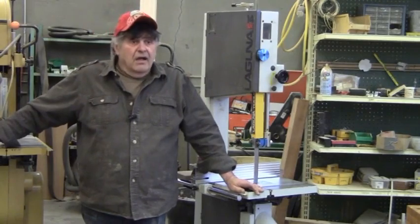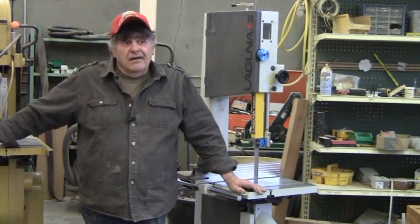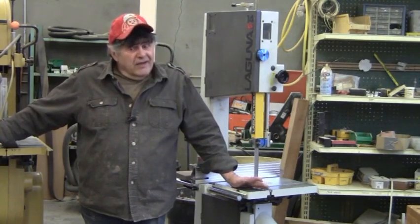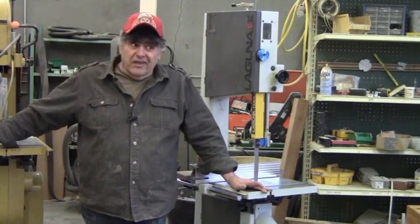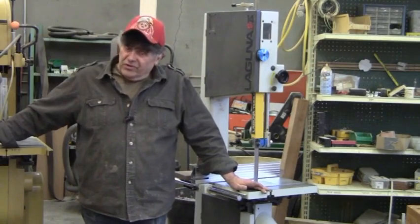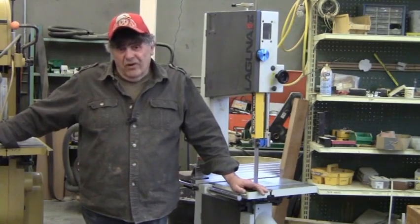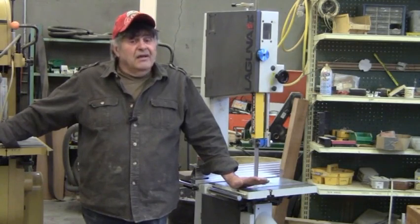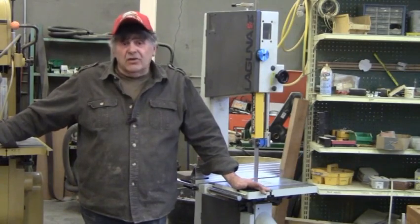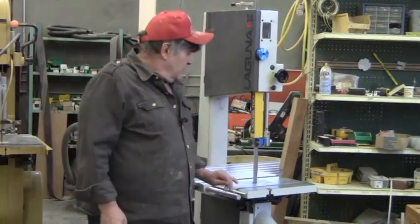Makes it beautiful. The other thing it does is when you're using nice wood, rather than doing a half blind dovetail, you've only got to deal with the front. The other thing is if you get a little bit of an oops, and that drawer isn't fitting just so, you can tune that up, and then when you put your drawer front on, everything's in alignment. It works really well. But the biggest reason we like it is we like to be able to do those sequentially matched drawer fronts. We also like, in many cases, to do what's called a book matched panel. What is that? I'm going to show you in a second.